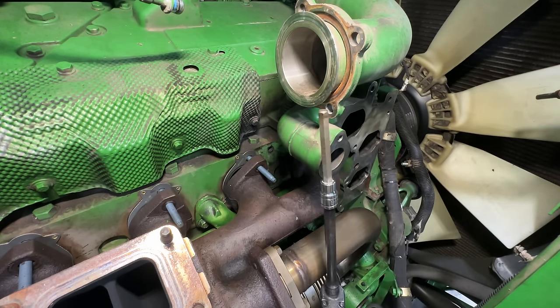I'm going to fill it up with coolant, and I brought a sump pump that I'm going to put in my coolant barrel down there, pump the coolant back up into here because the coolant's like a year old. It's still good. It's nice and clean in that barrel down there. So we're going to pump it back in. Deere says that coolant lasts 6 years or 6,000 hours. And it's like 18 gallons, so you're talking quite a bit of money there in coolant. So we're going to get our money's worth out of it and reuse it.